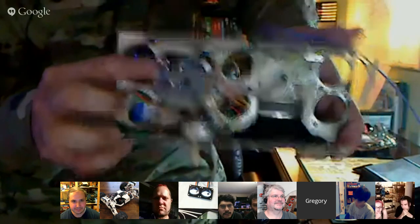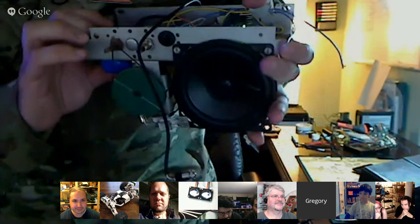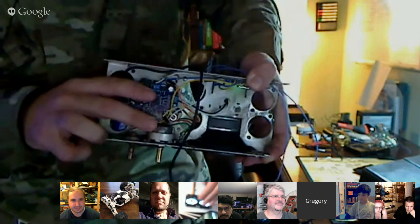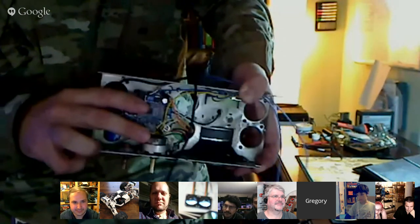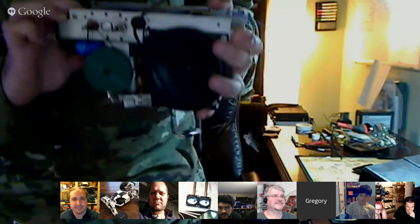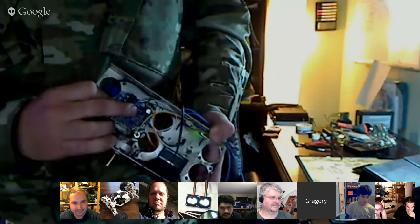Here you go. Stereo amplifier with a Power Boost 1000 along there as well, and it's hooked up to this potentiometer. It's a switching potentiometer, so it has a switch and the pot in it as well. Unfortunately, the pot doesn't work too well because I think it's meant to be carrying more current. It looks like they used to put AC current directly through this thing. Because I tried to hook it up to the power boost for the enable pin.